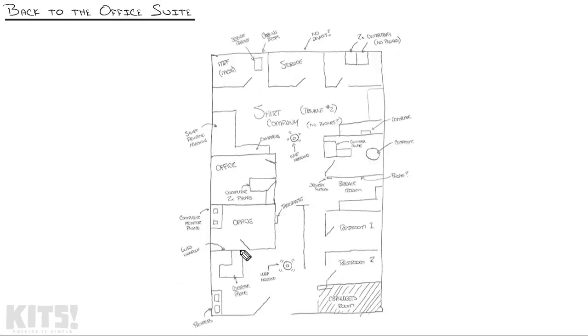We now have a Keystone jack installed behind the desk, as well as a tip added to the cable, so it's ready to plug into that wireless access point when we get to that point of the installation. Behind the scenes, I'm going to go crimp an end on this cable as well. But if you combine the last nugget and this one, which was installing that patch panel, we now have a cable run end to end that's ready to plug into a device on each end of the connection. That is so awesome, and I can't wait to move forward as we build this network environment.